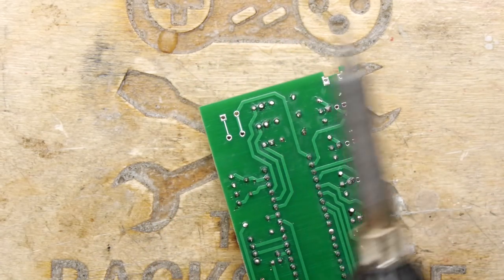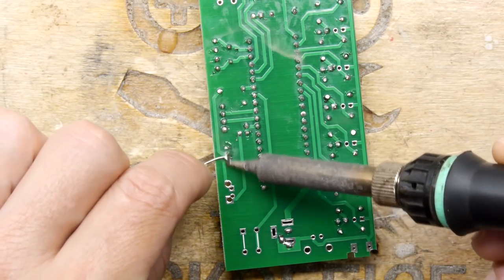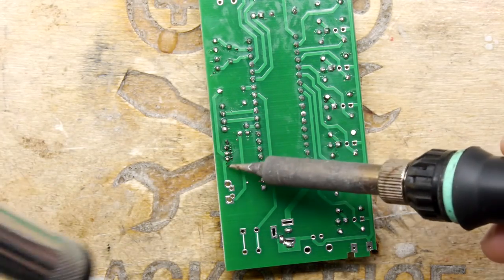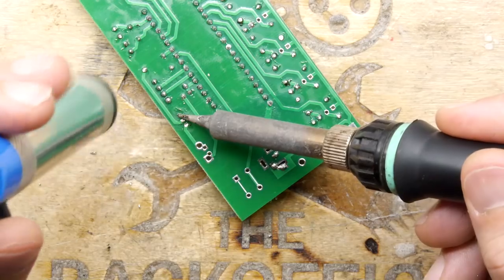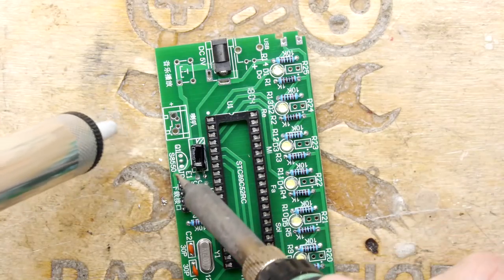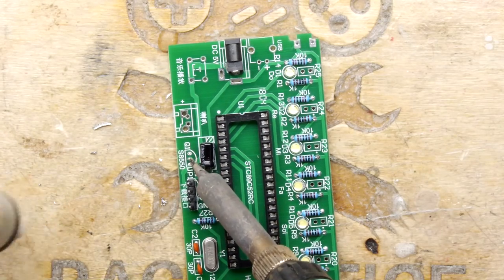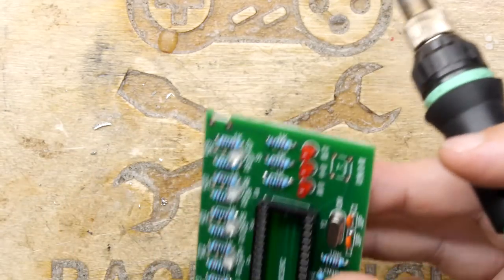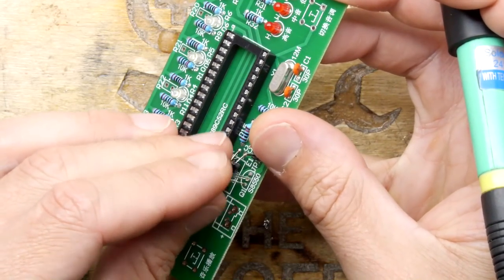So our holes are pretty much filled at this point, so you can sort of see an extraction now. We're going to fill them up with solder. Right there. Just going to use a solder sucker on them, which isn't doing the trick because they're jumping around. Let's do it from this side. No good. Could get out some solder wick, do it properly? Yeah, we could. Are we going to do it half-arsedly?